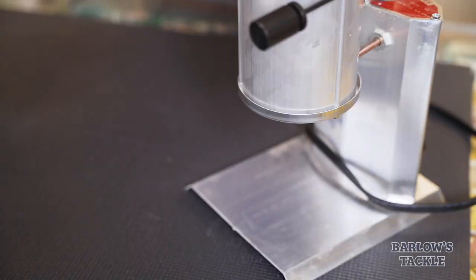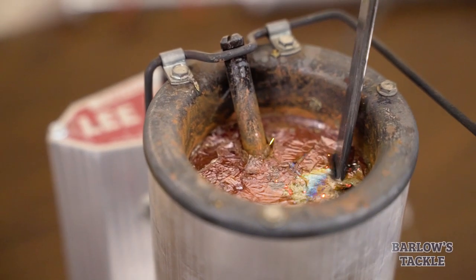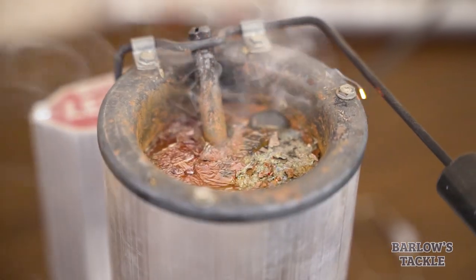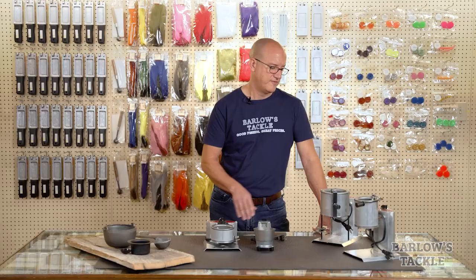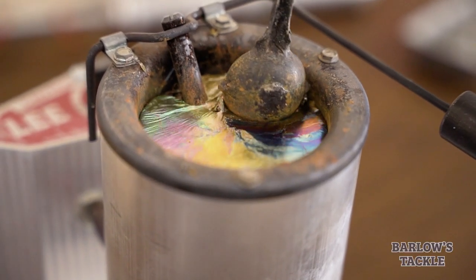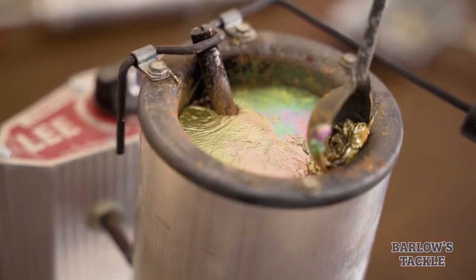Next, any molds with exposed wires — spinner bait molds and buzz bait molds simply don't work with these because there is not enough room under the pot to get the mold in place. Bottom pouring pots also need to be kept full of molten lead for best performance. All of that extra lead in the pot helps force the molten lead out of the bottom faster and helps you retain heat better so your lead stays hot longer. Finally, with a bottom pouring pot like these, your lead does need to be very pure. Any impurities like dirt or metals other than lead can over time foul the pot and cause it to stop working.